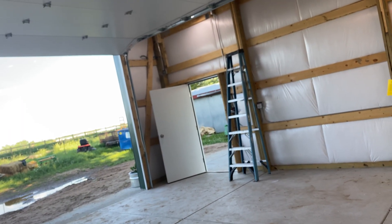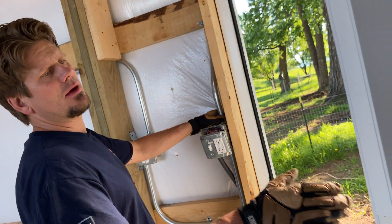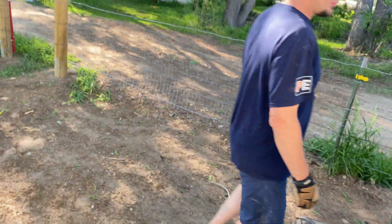This is definitely more of a shop. He is possibly doing some calving in the winter. You're not allowed to have hay in here. We did not do compression set fittings, we only did set screw. There are no bell box covers or bell boxes that are seal-tight, so you cannot have any type of agriculture in here. We made sure the customer knew that, because I am not ripping all this out.